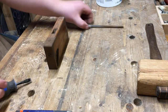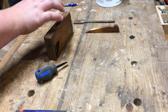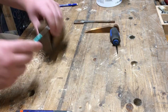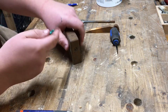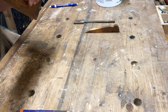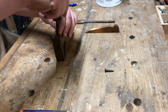I'm gonna take off this bullnose part and lay all the parts here. Now before you start taking screws out like this, I would get dental picks — also called mechanics picks — and take them into the groove and scrape it out to make sure there's no dirt. That'll make sure you don't strip out the screw when you're trying to twist it out; it makes the screwdriver fit more firmly in the slot. Simple screws. I sort of like the slotted screw look — looks very old-fashioned.